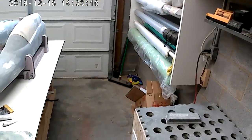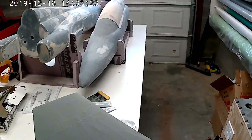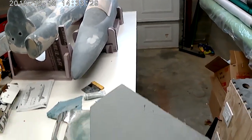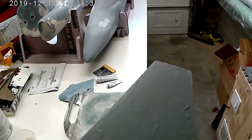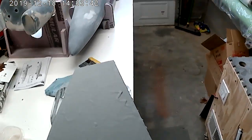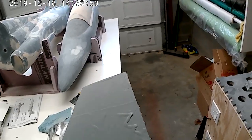After that, I started doing some work on horizontal stabs and that kind of thing. I used a product called Durabuild, which is just a typical automotive 2K primer. Typically you would thin this and spray it with an HVLP gun or whatever. I don't typically thin and spray this product — I just brush it or roll it on. In this instance I brushed it on, and you can tell it just looks horrible. But I did that because I wanted it to build up really, really thick really quickly so I could cover all these rivet details as fast as possible.